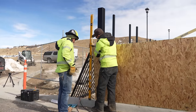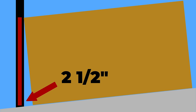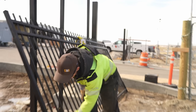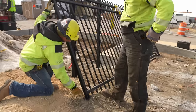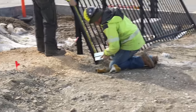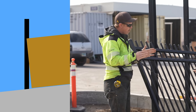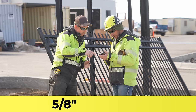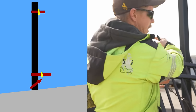So that's the angle of the roadway. Our slope is two and a half inches over four feet. The only thing we've got to do now is figure out the spacing between our hinges - the strongest option is the further apart the better, bottom hinge toward the bottom, top hinge toward the top. From top of the bottom rail to center of the top rail is five feet. So two and a half inches divided by four gives you five-eighths of an inch per foot, times five feet equals three and one-eighth inches. Our bottom hinge needs to be three and one-eighth inches uphill more than our top hinge.